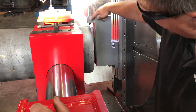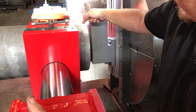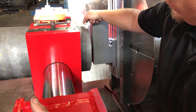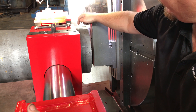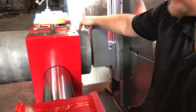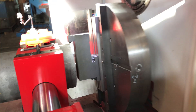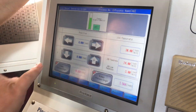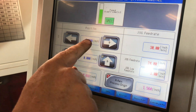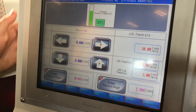Anyway, I've got a tool here that's going to allow me to come around the outside and cut a groove. Now this 12-inch pipe would require three-quarter inch in, and I've got a half-inch wide cut groove, 0.109 deep. There's a tolerance there, but now I'm going to do this manually. I've zeroed out my Z and X on the pipe so I know my dimensions.